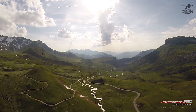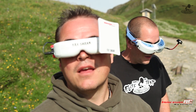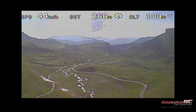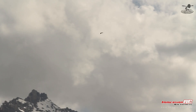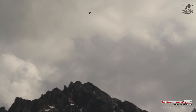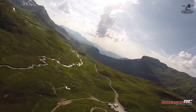Normally we fly through GoPros, but talking about optimal setups — we've had quite a few GoPro failures. You're flying through a 600 TV line Fat Shark CMOS camera — a cheap little camera with superb performance. And it can operate off 5 volts, so you can plug it right into your receiver. With 12 volt cameras, as the battery gets near the end of its life, your camera performance suffers.